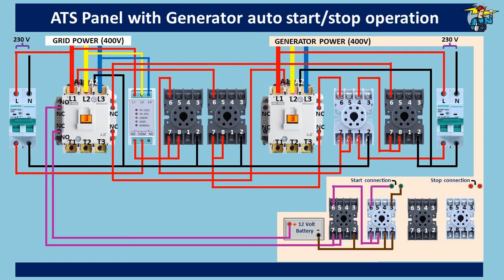If the generator has start connection points through the solenoid connected to the starter motor, you need to connect and hold those points together until the generator starts after cranking. Generally, cranking should be stopped after two to three seconds, and the generator will attain its normal RPM and voltage within a total of three to five seconds. For a system like this, you need an additional relay switch operating with the generator run signal to discontinue the start-points holding line after the generator starts. Generator start points can be connected through port one — the common port — and port three — the normally open outlet port. The additional switch, operational through the generator run signal, is a normally closed switch and only opens when it receives the generator run signal.